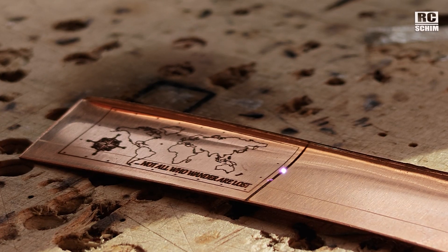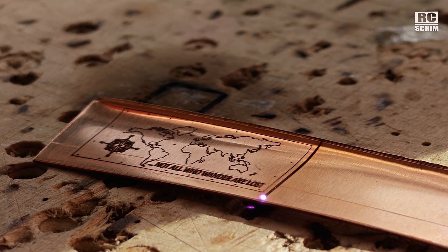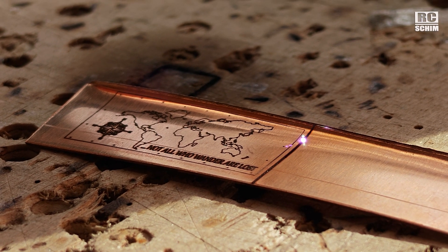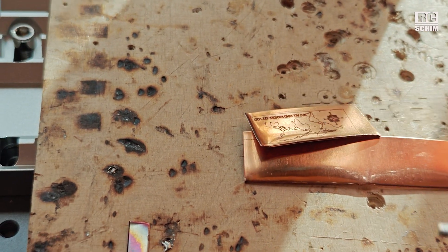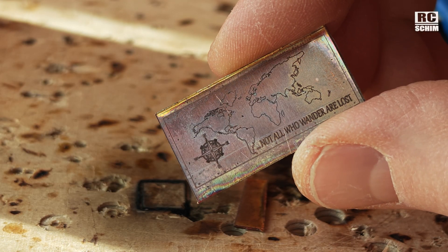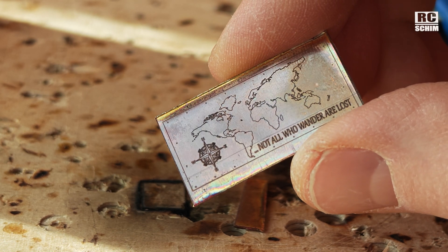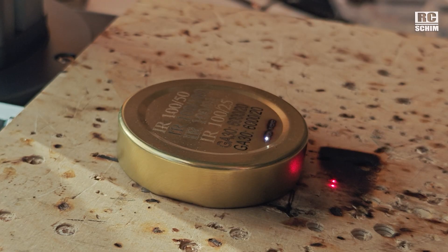Trying to cut copper here — 0.6mm copper, used multiple passes and slow speeds at highest power. It gets really hot so the metal gets color changes. You can bend it, but for more complex cuts it might be a problem, or you'd need 10 more runs. This is a 15x35mm engraving — very tiny — and a lot of those tiny details I like it on copper. Found this from my last review with a 2W laser. Now using 6,000mm/min at 20% power, which is already way more capable. Now I use 100/100 — quite slow at 100% power — and a lot of smoke happens.